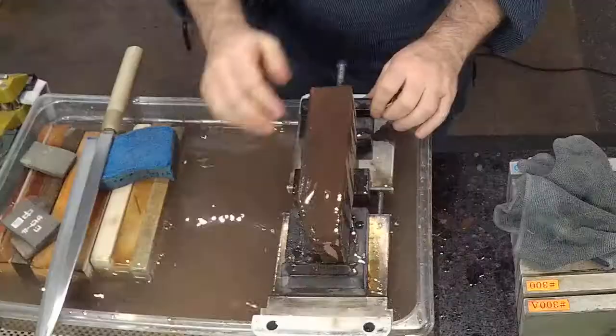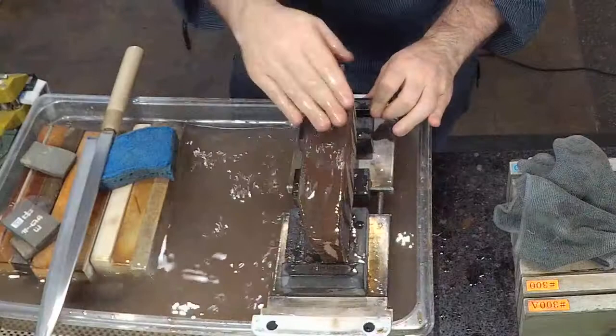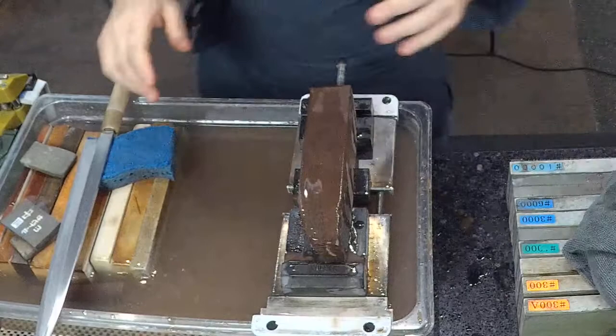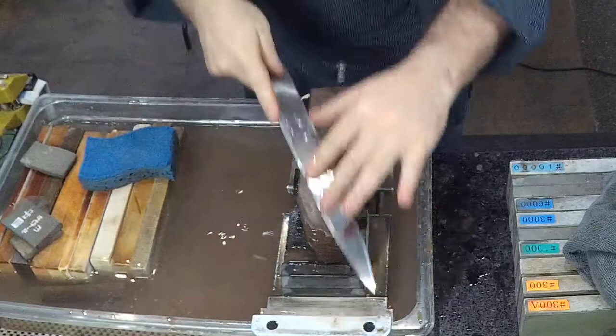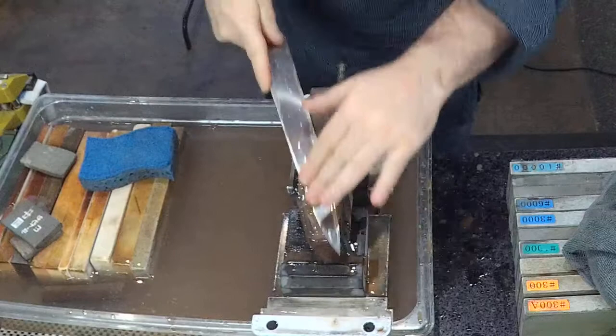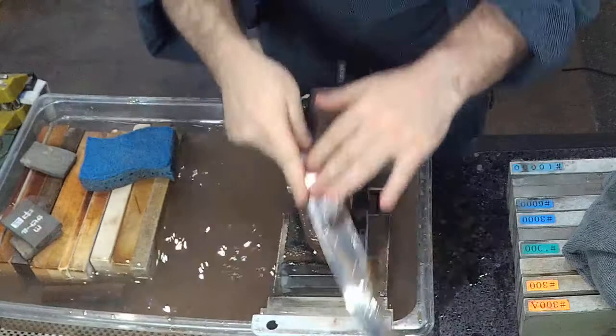Moving on to the third Monzento — 45mm x 60mm x 195mm, progressively smaller. It's pretty narrow, which might be tough for larger knives but better for small chisels or similar. It's a medium grit stone. It feels immediately less coarse than the last one with a bit more reddish-brown color and a cool blue streak. It's soaking in less water and holding it on the surface better.